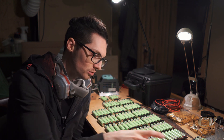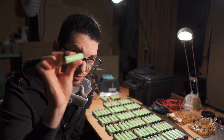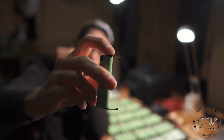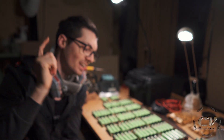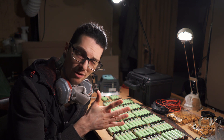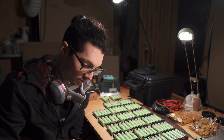Now I'm ready for lots and lots of soldering. Let me explain what I'm going to do. This is one pack with cables and the connector, and this is one battery. They come with soldering flaps — little wings — but they're protected by a heat shrink tube. First I have to remove 300 heat shrink tubes — that's crazy. Then I'll bend the flaps to the right position, measure every cell in case there are dead ones, prepare the wires, then solder them, then cables, then the connectors.